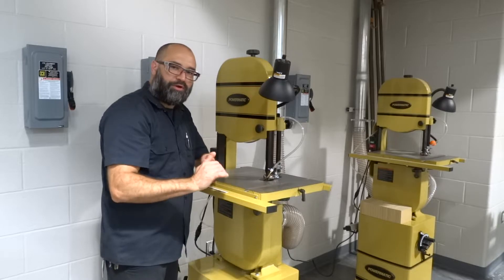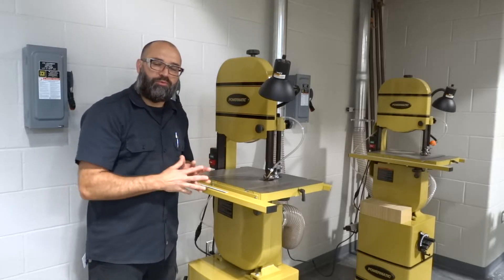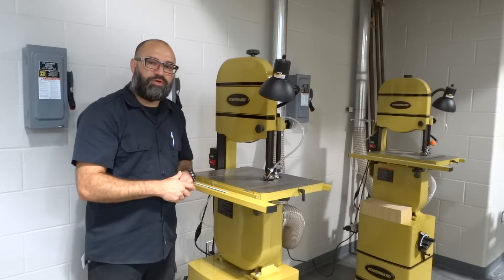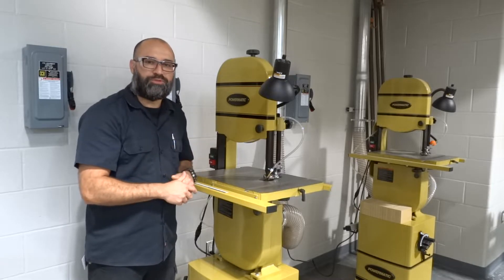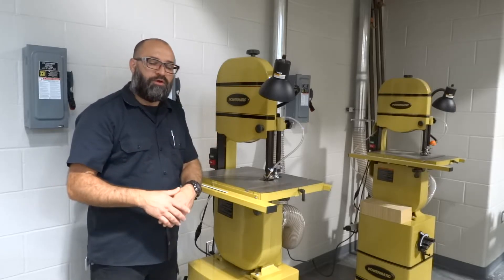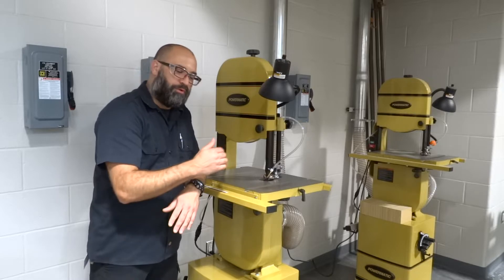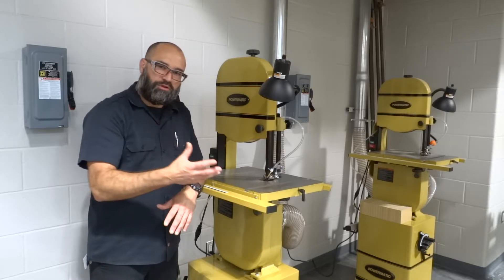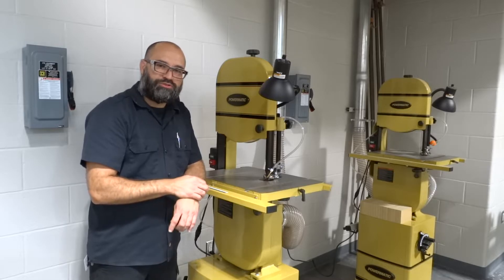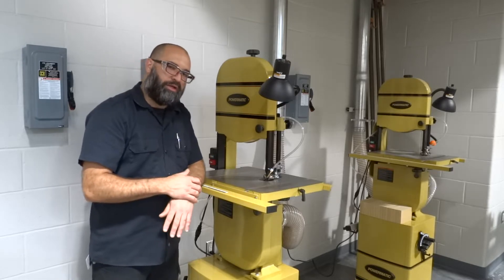Those are the things we need to be aware of. Now let's discuss how do we actually use this machine. Before we use any machine in a woodworking shop, we've got to make sure we take care of wearing our safety glasses. After you've got your safety glasses on, if you've got long hair, you tie it back so it doesn't get hung up in a machine. After that, remove any jewelry such as necklaces, lanyards, bracelets, rings — anything that's going to get caught in the machine. Any type of loose clothing that could potentially be caught in the machine, we need to remove that or tuck it in. If we're wearing a sweater or jacket, those things need to be removed so we can see from our fingertips to our elbows.